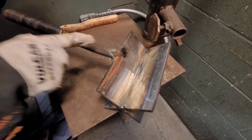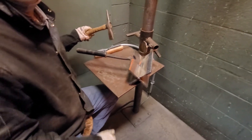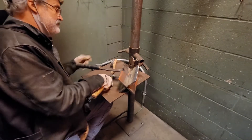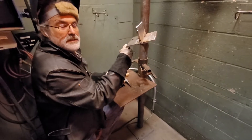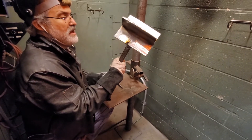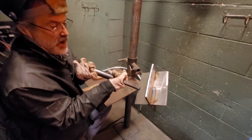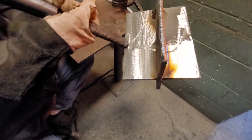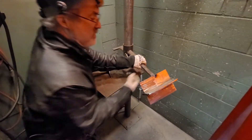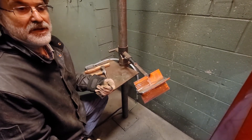As I'm welding, there won't be any bump there that gets in the way and makes me have to go around it or make some kind of mistake. It's good to clean that off and shake it around a little. Sometimes people get the handle on so weak that it will fall off. If we have a weak connection, just grab another rod and add some more weld. But we don't want to weld on the inside or weld all the way around the handle, or else we won't be able to break it off later.